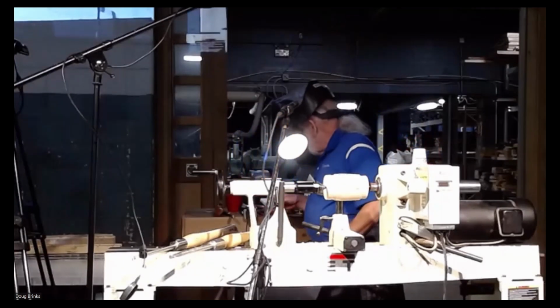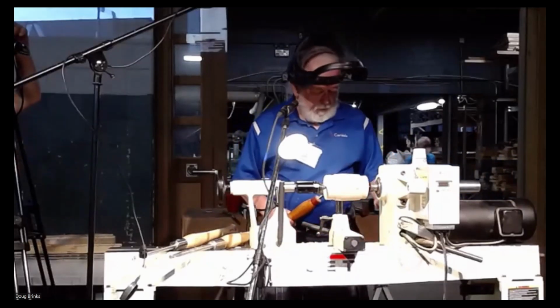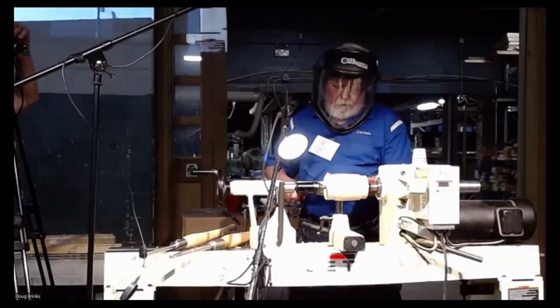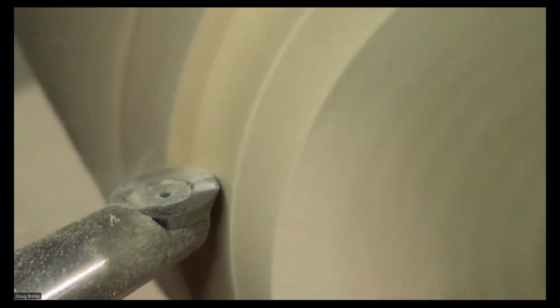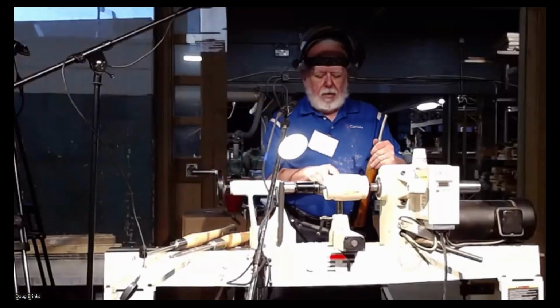If I was to cut with a flat top 12 millimeter, and if you noticed, with every cut, I lightened up. So there's a cove on dry maple, probably a 220 cut, okay? But this, so keep in mind, shear cut, flat top, shear cut.